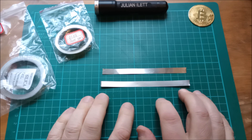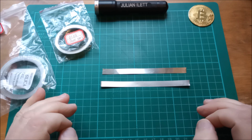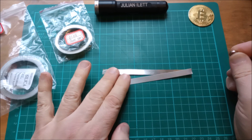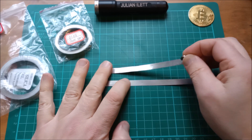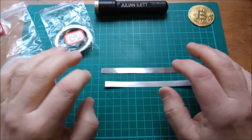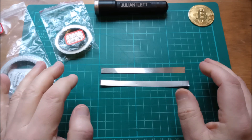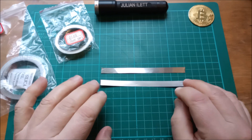I've cut a couple of lengths of these two metal strips. Now what if I get them mixed up and I don't know which is which? Can I use a magnet to work it out? No, because nickel is attracted to a magnet and nickel-plated steel is also attracted to a magnet. So I can't tell them apart with a magnet, which is a nuisance. One commenter suggested leaving them outside for a few days to see which one goes rusty — well that's not very practical.